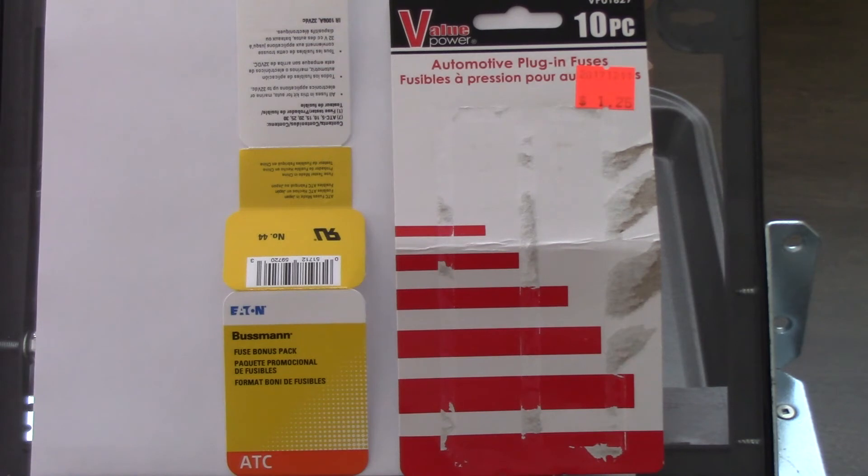Here's what to look for to ensure you're getting a good quality electrical product. They should have a UL, a CSA, or other accredited approval agency marking on them. These particular fuses from Bussman have a backward UR and the number 44, which is a recognized component mark — a type of quality mark issued by Underwriters Laboratories. It's placed on components which are intended to be part of a UL listed product but which cannot bear the full UL logo themselves, so the general public does not ordinarily come across it.